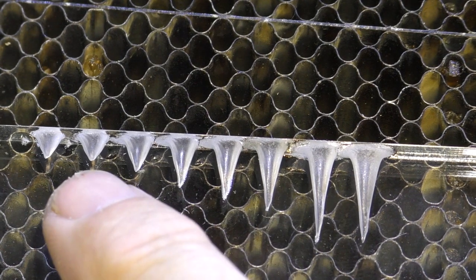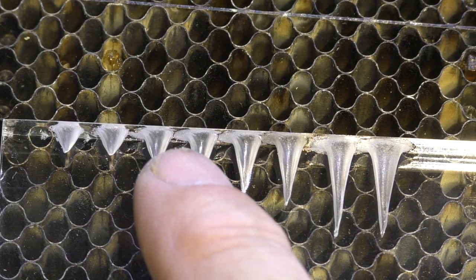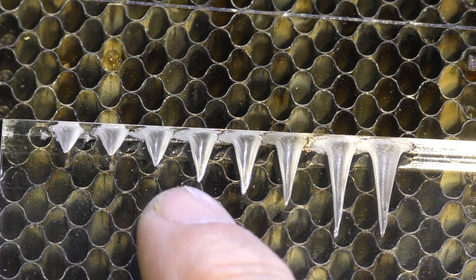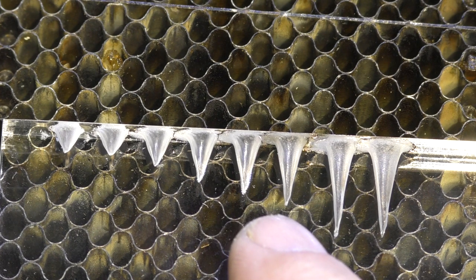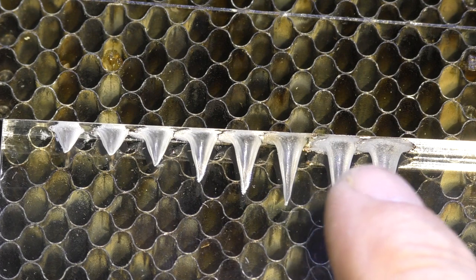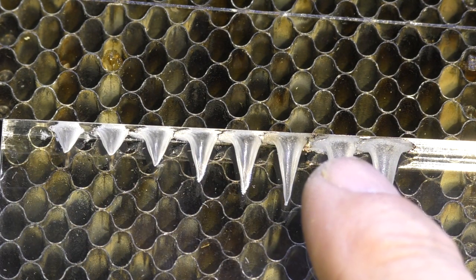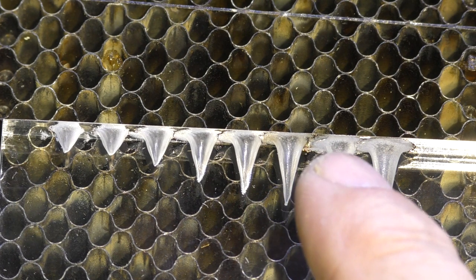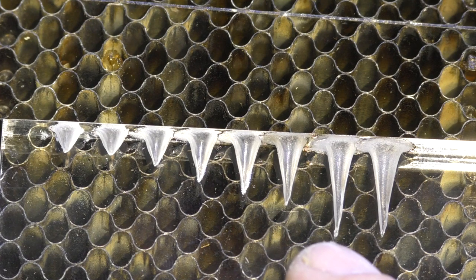Well, I think you probably get the idea here. As we allow more and more time, the centre part of the beam, which is the high energy part of the beam, starts creeping forward at a much greater rate than the outside of the beam. Look, you can see virtually all of these are the same size at the mouth of the beam. It's just that the beam has managed to bore its way in deeper and deeper and deeper,